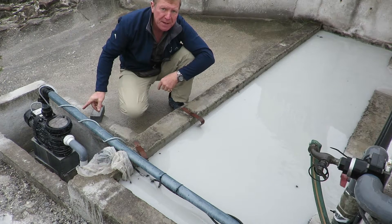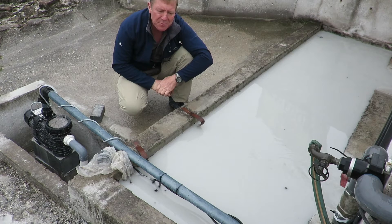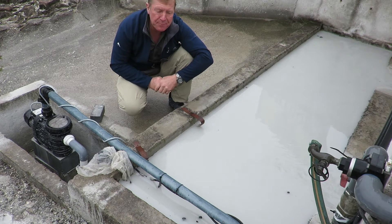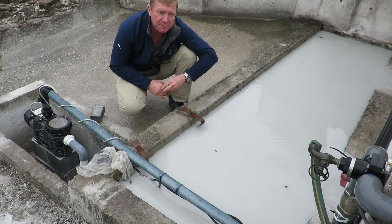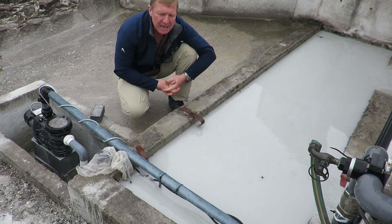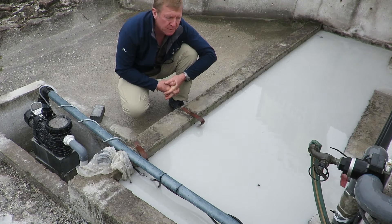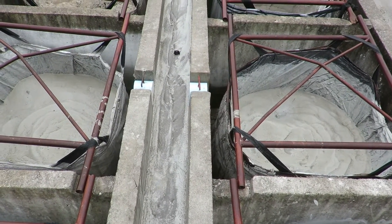It's very hard on the pump. We use a normal swimming pool pump and end up having to replace it every two to three months — it messes up the seals, messes up everything. The silt in the water is very abrasive, and it's also got a lot of super-fines in it, which definitely causes a lot of grief with any mechanical seal.